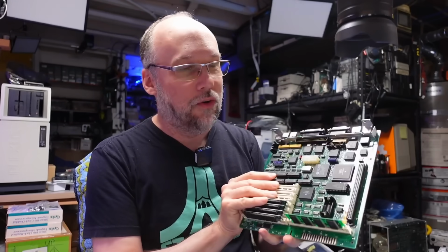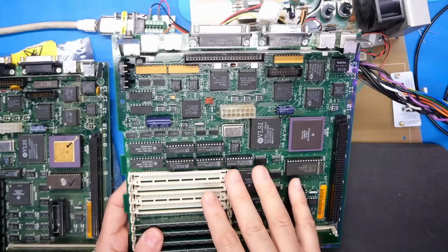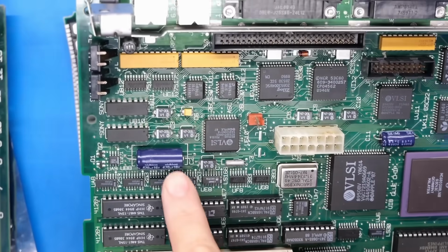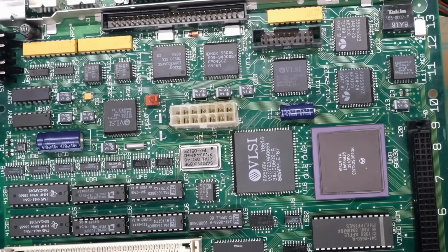Now, the other board I alluded to, as in the one that I think I'm going to try to repair in this video, is this SE30 motherboard. We can tell them apart because it's got white SIM sockets versus this one, which has black ones. Now, this board was another one that I came across that I didn't show in that second channel video where I was troubleshooting these different SE30 motherboards I had, and this one also has a fault. So this motherboard, I don't think has any kind of faults when it comes to 12 volts going through the voltage rails. You can see that this thing has been recapped, and it wasn't done by me actually, but these are tantalum caps that are on here. But this thing definitely had leaky caps at some point, and it was obviously cleaned because it's super clean. But this motherboard has some really interesting faults.